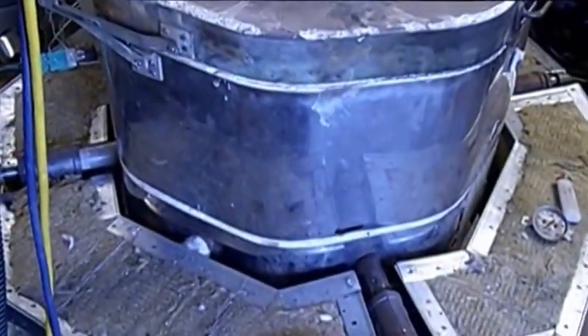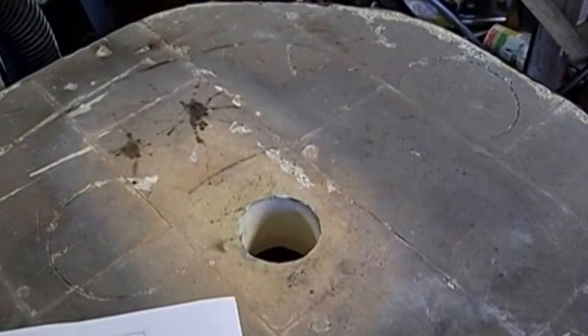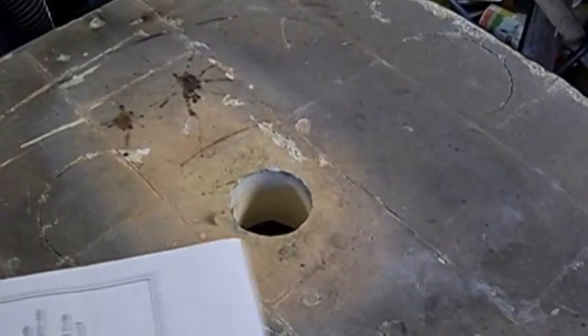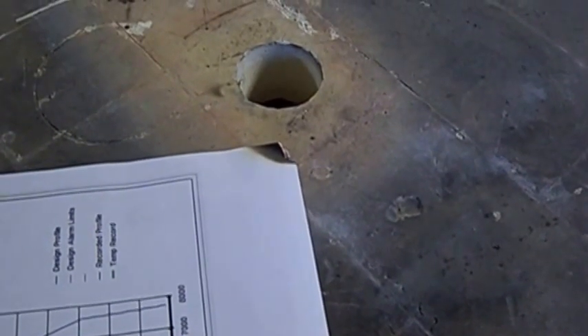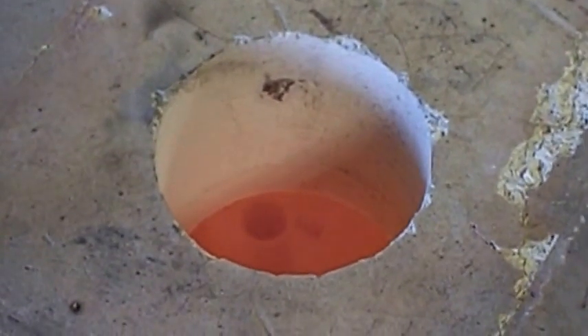One thing I wanted to show you is just how ridiculously quiet this thing is - some people stopped by and didn't even know it was on. Just to prove it is running, I'll stick a piece of paper over the vent - it's definitely putting out some heat. We're now up to 829°C and it's glowing a nice red-orange color inside. I checked with the oxygen probe and we're running at about 1.4 lambda, so I'll leave the airflow alone for the rest of the cycle. Everything's working fine.